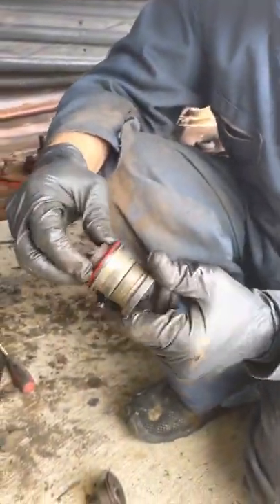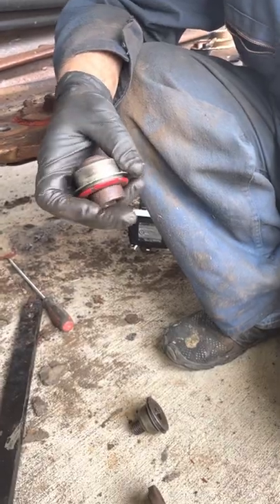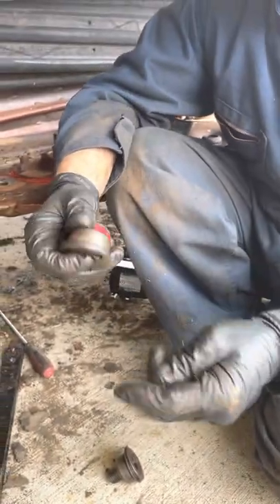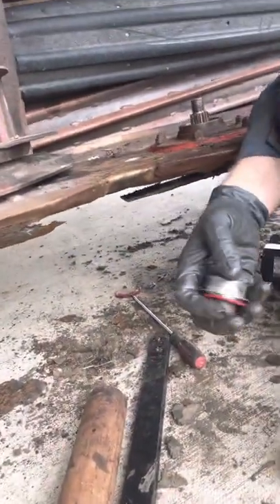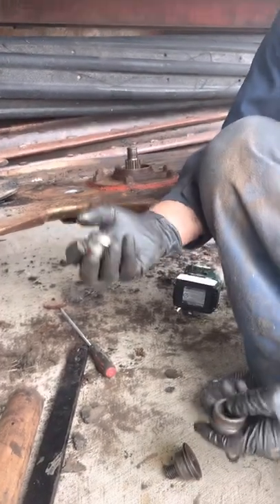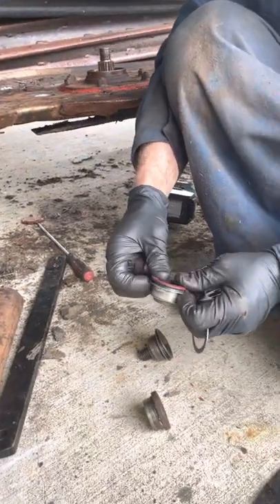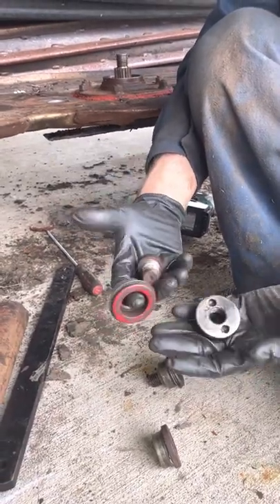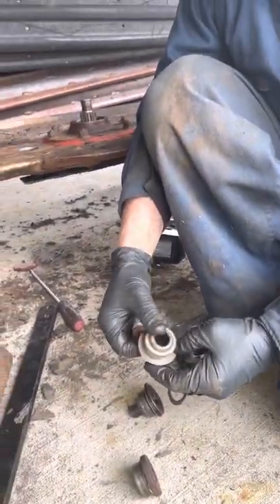But if you're in a bind, what you can do is order these shims — there's a thin shim and a thick shim. That's the thin shim right there; I've already used my only thick one. You're basically just trying to seal it up and tighten it — get it tight to the bottom housing. They just ream out over time, so you need more space to pull them together tighter. You can order these from the disc mower doctor. Used ones are about 30 bucks, or brand new is around a hundred bucks.